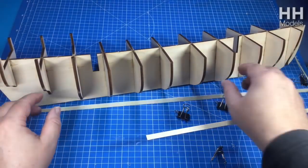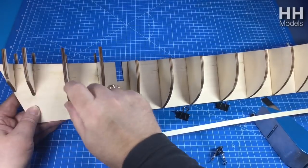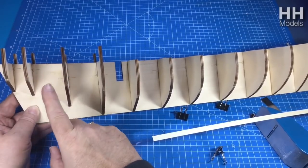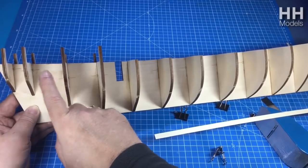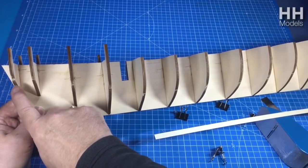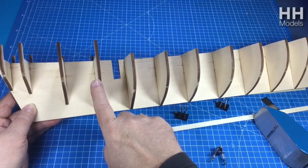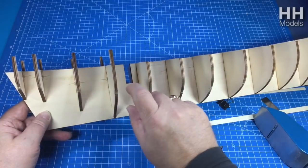The middle section is probably going to have tapers front and back. Despite the wedges used in the bottom section, the middle section planks will actually need to get quite thin — you might even have to do step-downs here because you may find the calculation says they should be 2mm wide but you can't taper 6mm planks that far. So you find the point where they're at 3mm, step down there with a new full-width plank, and work out the right dimensions. Here at the stern it was four planks of 24mm, but in the middle it's six planks of 36mm, so somewhere in between there's five planks of 30mm, with the step-downs worked in accordingly.